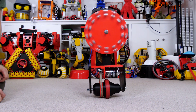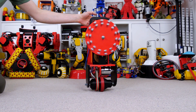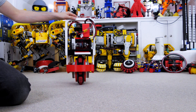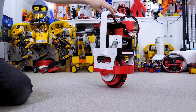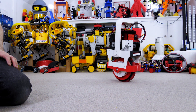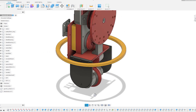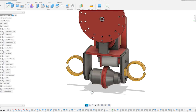That seems to be working pretty well — I'm pretty happy with how well this balances, and it's actually better than my two-axis active omni wheel robot from a couple of weeks ago. That robot can slide sideways to balance because it had an active omni wheel where the little wheels around the circumference are driven by another motor. Both robots seem to balance okay, but neither can really steer because they have no way to turn in yaw. I was thinking about adding another reaction wheel to create a yaw force, but I've decided to do something else.